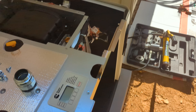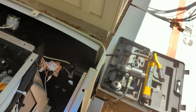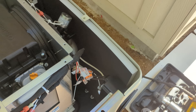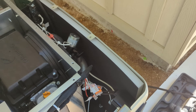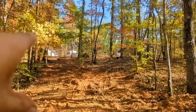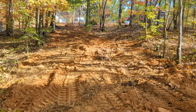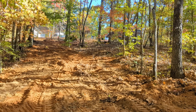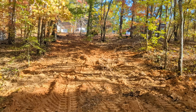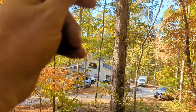When you do these installations, first you need to get the battery connected, then the power conductors — the battery charging circuit — and then the two-wire start. Back here on these Wago connectors. Another peaceful off-grid installation — we've got three arrays up there. The trench is roughly backfilled. I usually leave it pretty rough when it's in the woods so the water doesn't pick up any trench line — it'll randomly run off down the hill.